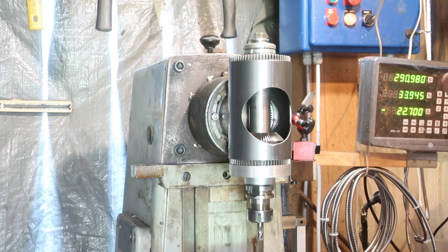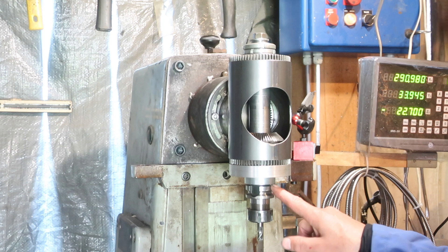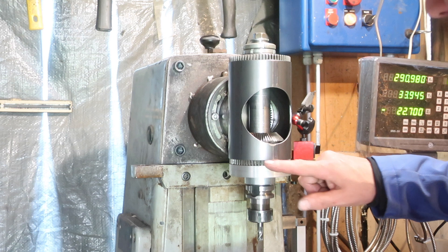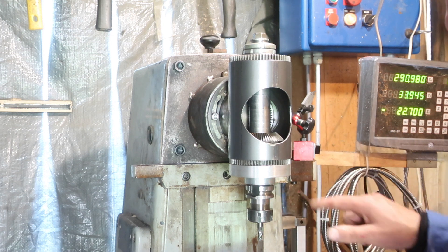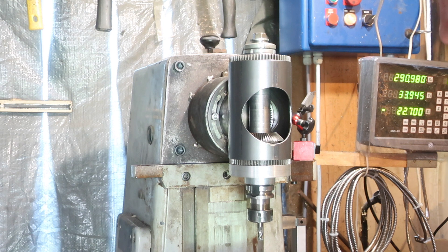What's missing at the moment: none of the gears or shafts are hardened, which is not great for taking deep cuts. They need hardening and then the spindle bore needs grinding. The bottom bearing casing is not sealed for the moment, so when you put oil in it, it drips out the back — around what used to be the gears.